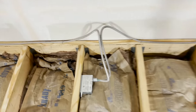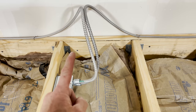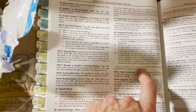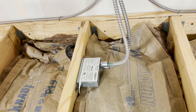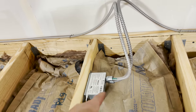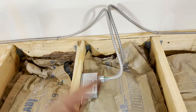Let's look at my own wiring - MC coming in and out of the box. MC has to be strapped within 12 inches of any enclosure it goes into, and then every six feet. For the purposes of this section, MC cable fittings shall be permitted as a means of cable support. So within 12 inches of the box, the fitting itself counts as a means of securement and support. Yes, that's cheeky, but it does count as a strap. Then about two feet later there's another one, and we don't exceed six feet - probably four feet on each side. That is to code.